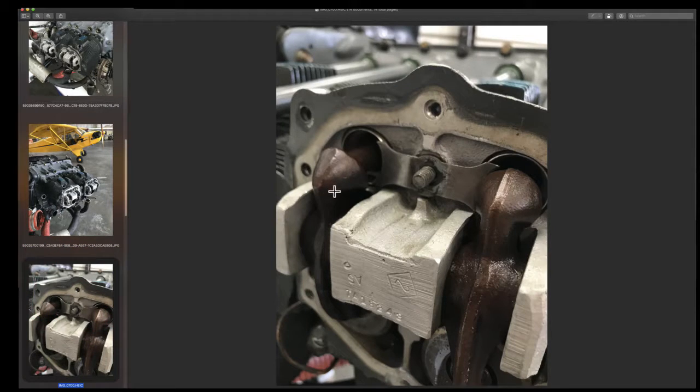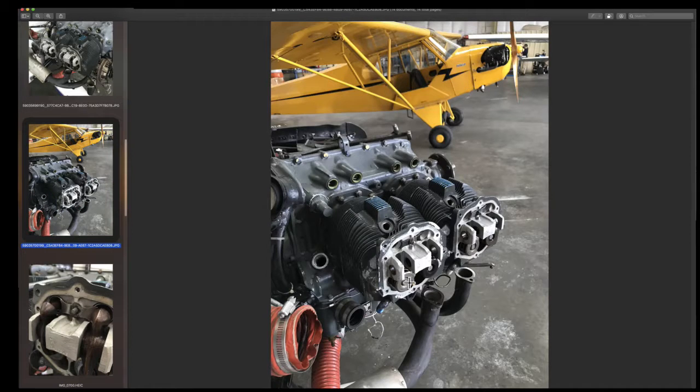These things, to get those in there, are a pain because these things under here are springs, and the rocker arm sits against that spring. So you kind of have to push that spring in and then get the rocker arm in there to push that cylinder through so that they are fixed in there. And this is really one heck of a job trying to get that.